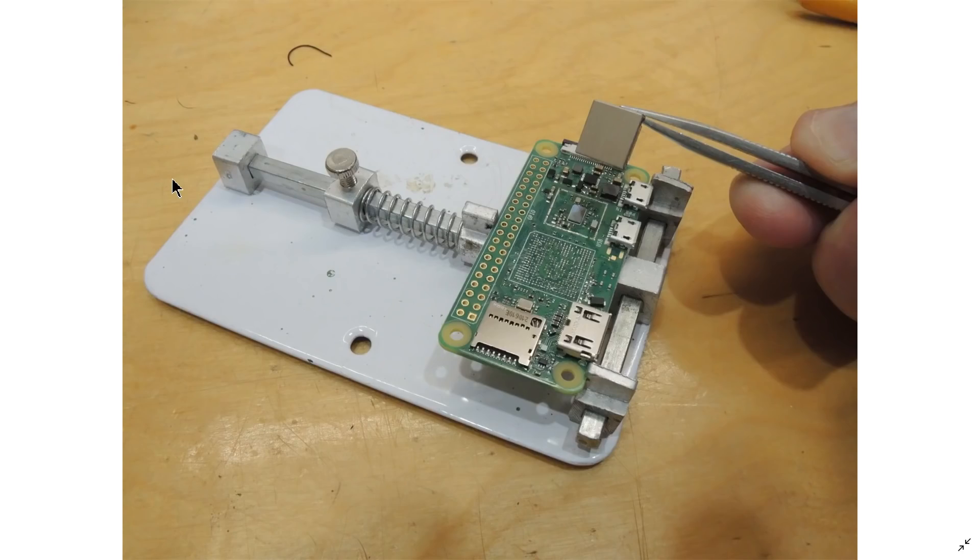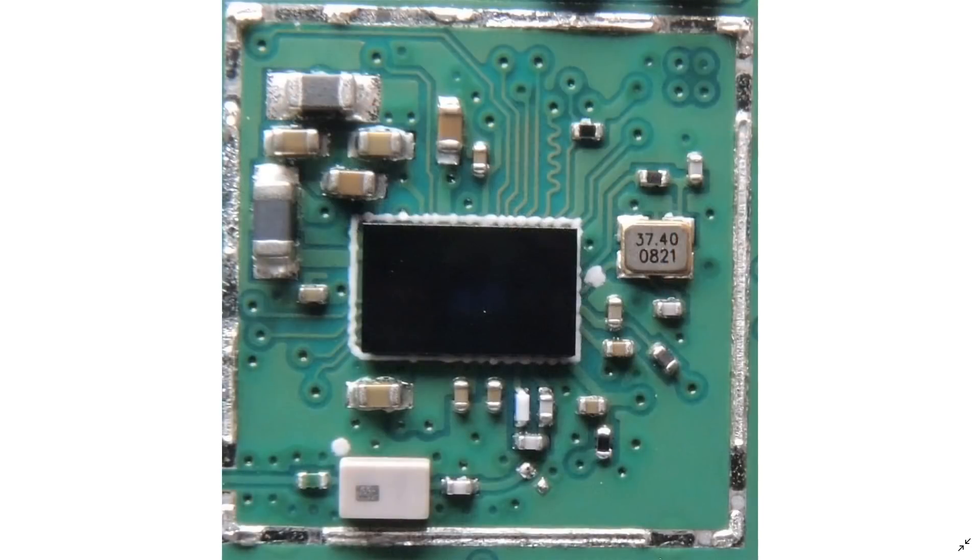Let's take a look at the RF section of the chip. You can see I'm holding my tweezers - I've taken the little metal lid off, which is basically known as a Faraday shield. It keeps the RF signals inside from leaking out, which is important for getting certifications like FCC. You can see here a very black-looking item - it's a chunk of silicon, specifically the very back of the silicon die. There's actually no epoxy around this device - it's known as a bare, bumped die. We'll flip it over in a second.